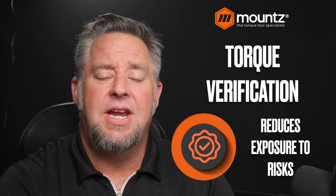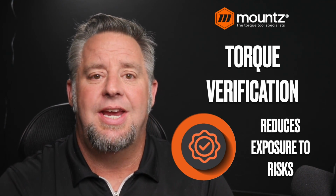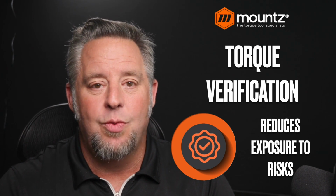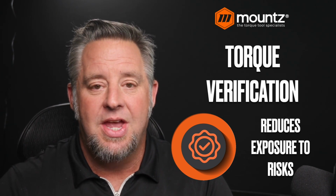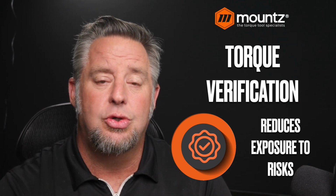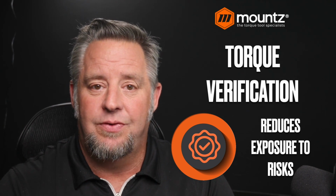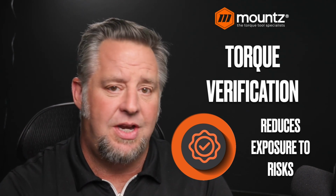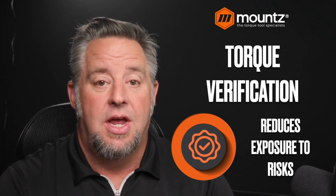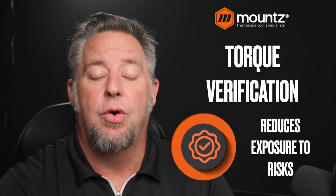And again, this would be having the ability to go to the line, test your tool on a periodic basis, and make sure that it still is within the calibrated limits. Because the last thing that anyone wants is to have a tool sent out for calibration, have that tool come back, and with a certification that was saying that the tool was found out of its specification. And now this begins the process of trying to figure out at what point did the tool go out, if it is a 6-month or 12-month calibration, what parts were affected by that tool, is there a need for rework, is there a need to do any type of recall or things like that.